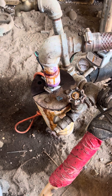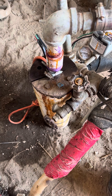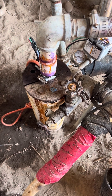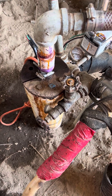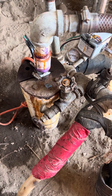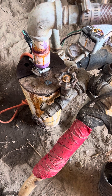Anybody that does this by hand or by themselves: always cord that pump. Have a long enough rope, cord, or wire — something strong enough to hold 50 to 100 pounds. That pump is probably 100 pounds plus the pipe.